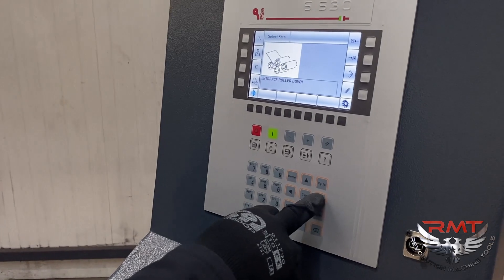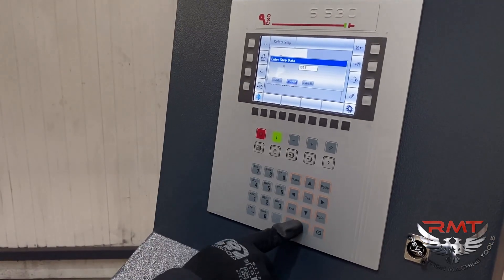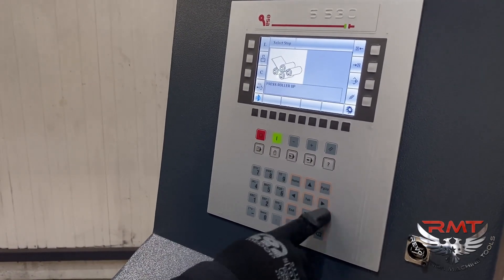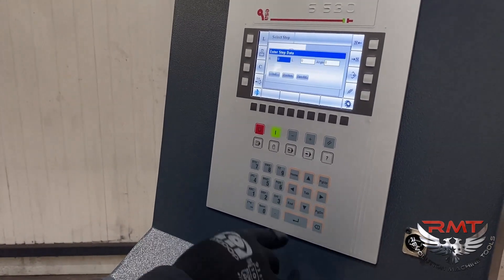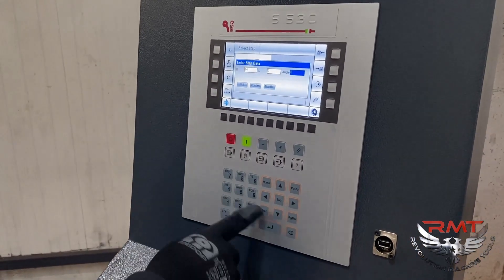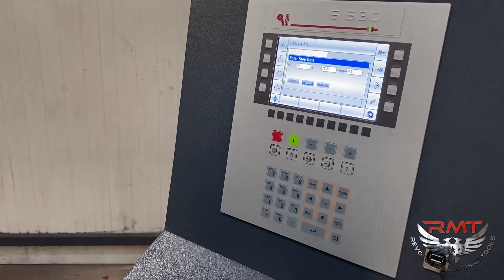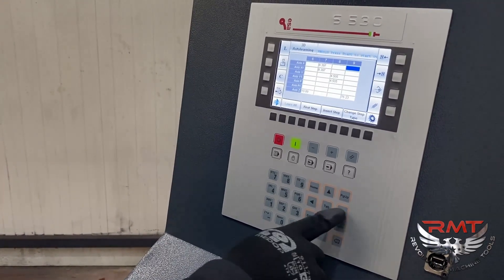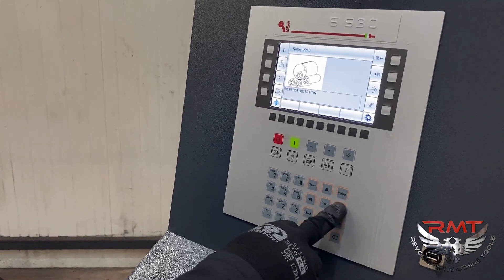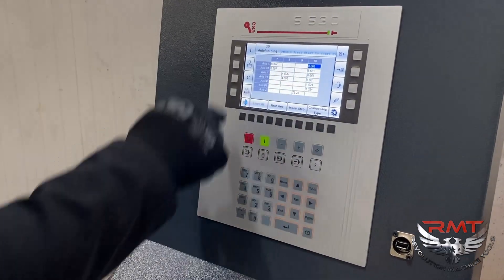Now for rolling — press roller up, radius is 14 inches. Step nine: press roller up and forward rotation. I'll add 14 inch radius, and since I already have 45 degrees of pre-bending, there are 315 degrees left for rolling. Confirm. The last step — step ten — is lower roll down. The machine knows all the parking targets.